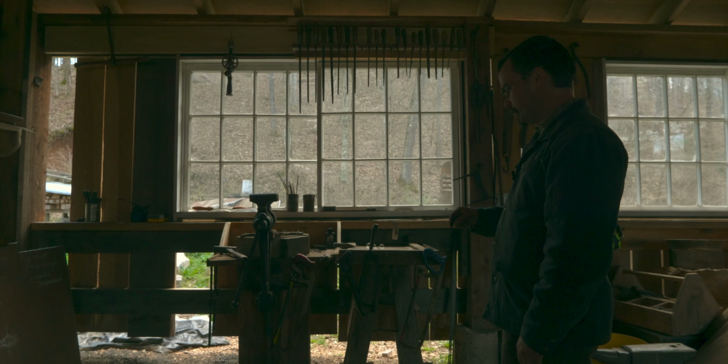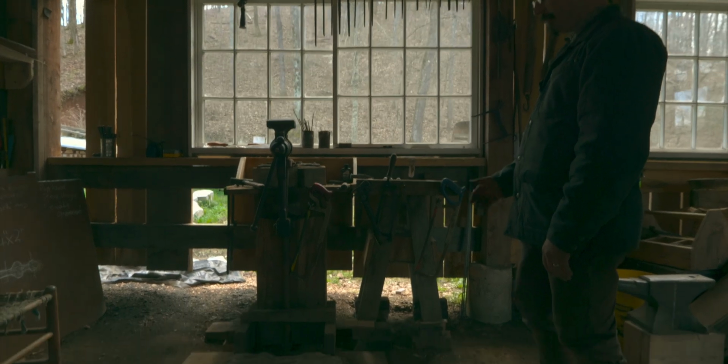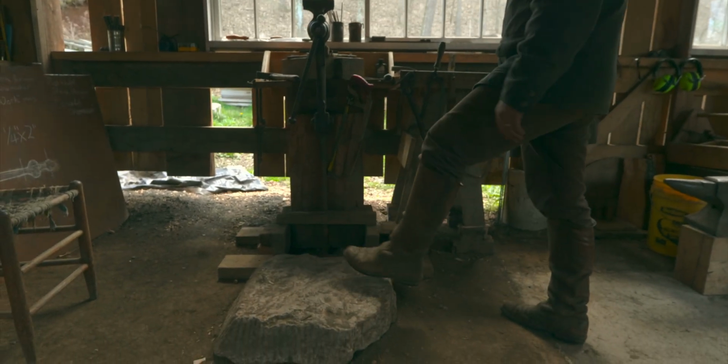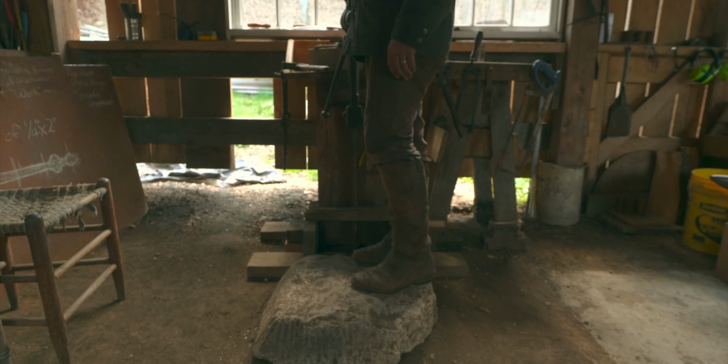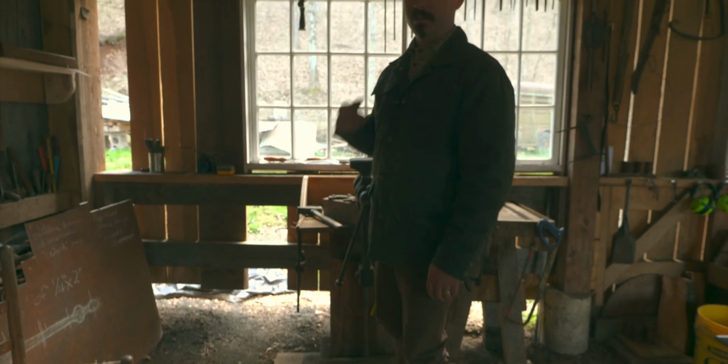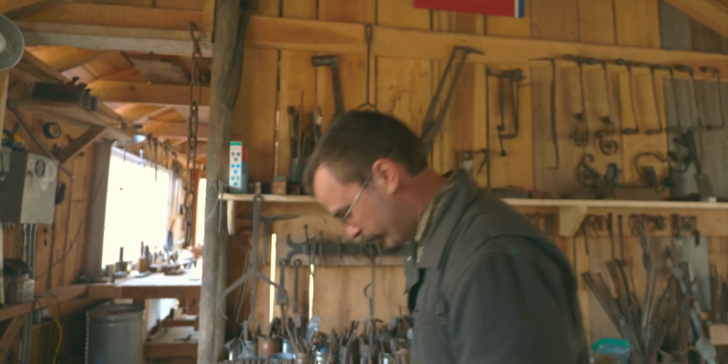This vise is really tall, and it's mounted on a stand where the foot is just a little bit above the ground. So I have to have this stone here to bring the vise up to elbow height, which is about right for most work. They say knuckle height for your anvil face and elbow height for your vise, at least if you do much file work. Hi, Maggie.